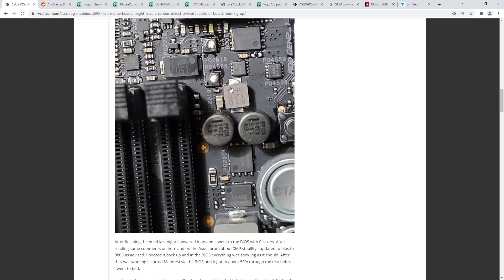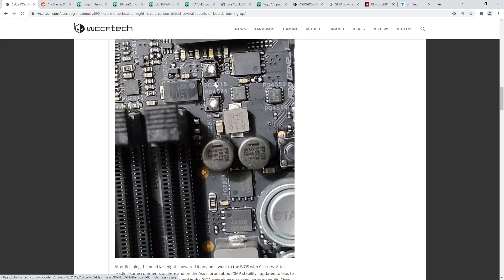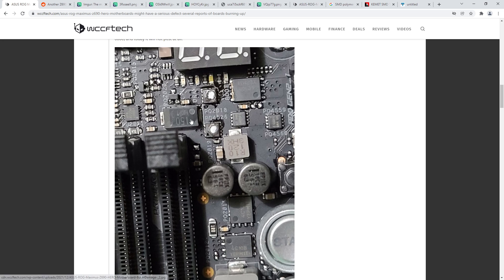That's my theory on why you get error 53 on these boards when they fail. But why do the MOSFETs burn up? A lot of people might immediately say the MOSFETs are burning up and that's why it fails - yes, but why do the MOSFETs burn up? Because these are probably just power distribution or power sequencing components. They really shouldn't be getting hot. They're not switching on and off. Why would these burn up?